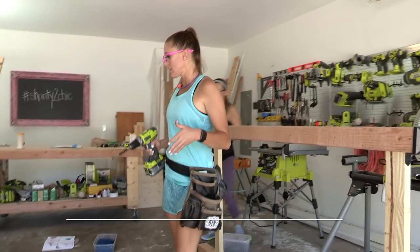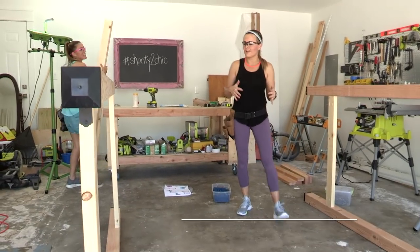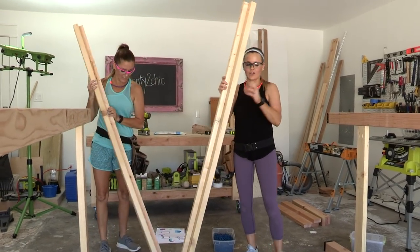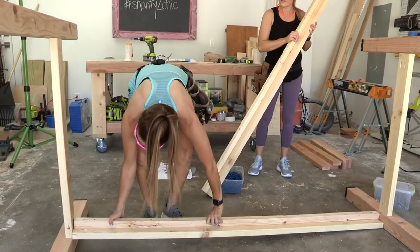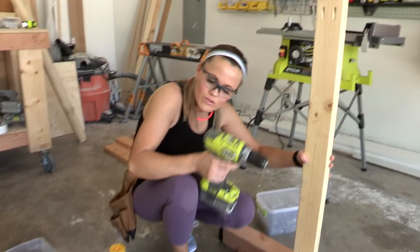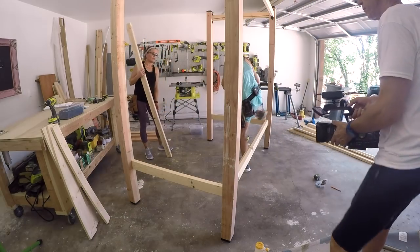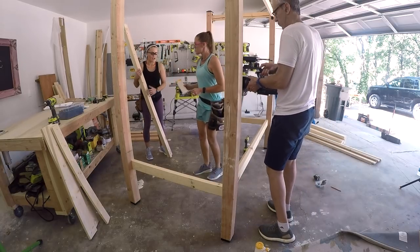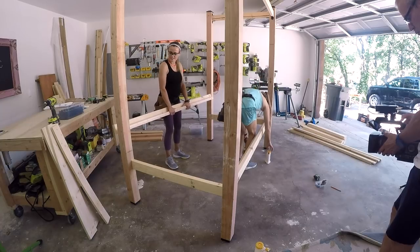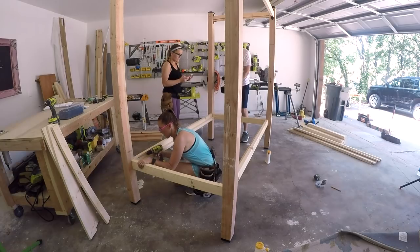Top supports are done. Now we're going to move on to the bottom frame supports — these are 2x4 boards. We've gone ahead and added the 1.5 inch pocket holes into the cleats. We're using 2.5 inch pocket hole screws and wood glue. We've got that frame attached and now we're setting it up to attach the other one. We're attaching the front runner using pocket hole screws and wood glue while one person holds it in place.